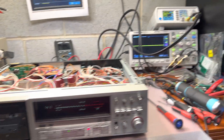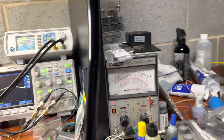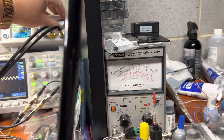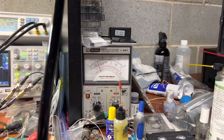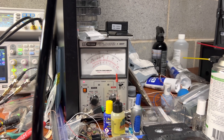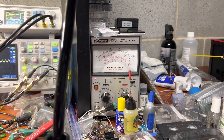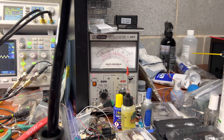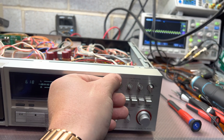Let's see how it records now. So one kilohertz — a little bit off between left and right channel. I was off on 10-11 kilohertz. When we go left it's the other bias — you see it reduces. When we go right, nothing happens. Unfortunately, I don't see the bias pot working properly on metal tape.